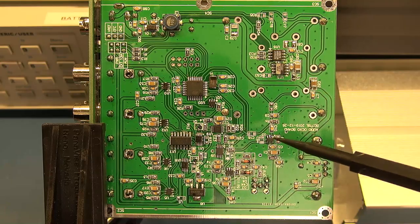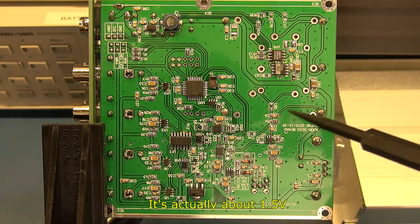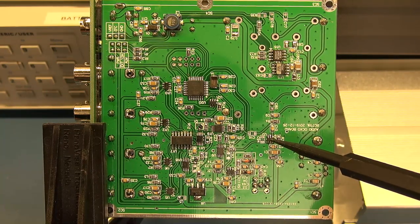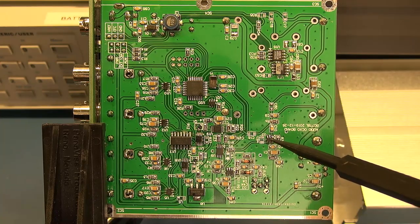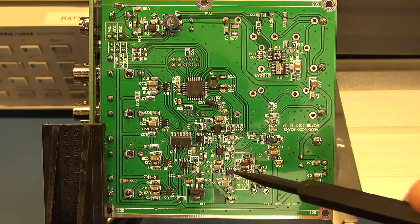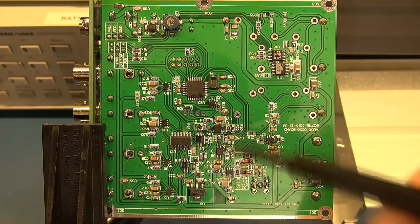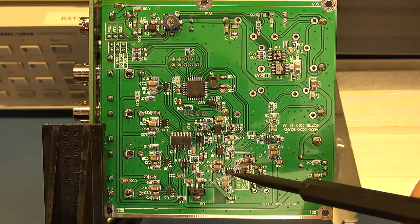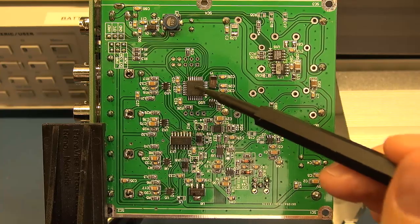One of these takes the 10 MHz sine wave — around 3 volts peak-to-peak from what I recall — and bumps it up to 5 volts peak-to-peak. We'll see what that signal looks like as it transitions through. There's a repeated configuration for the external input path with another signal amplifier. I'm assuming the MCU intelligently switches between either the ovenized crystal or the external input, controlling the LED on the front — that's one of the things the MCU is doing.